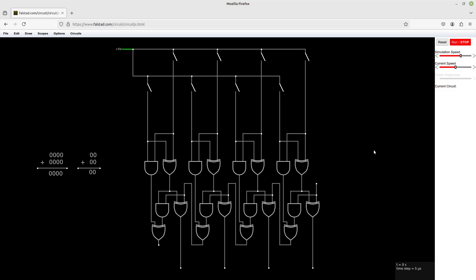Alright, so let's get to the main topic today. You'll remember this circuit from before, from adding two binary digits together. It basically looked a little bit different — they weren't staggered quite like this. I did that to make it a little bit more compact. Also, in that video, we didn't have this circuit here. What this does is it allows us to work with carrying. So this is actually an add-with-carry circuit.